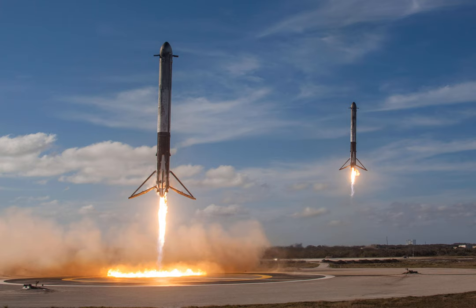A picture of the dome with the missing center — where the puck is to be welded in — was difficult to find. So the dome-to-sidewall welds were the initial problem; they think they solved that. Then this time, it looks like it failed at that center puck in the middle of the bottom dome. Here is a picture of the thrust structure with the dome sticking out and the space for this puck available and not yet welded in. This is from the SN1 build. A screen cap from a video of the structure being turned over shows the puck in the center — this is also from the SN1 build.